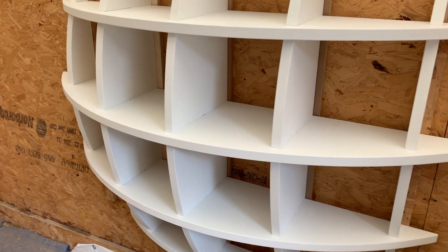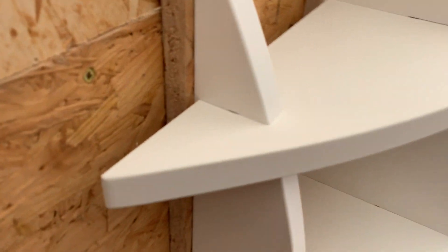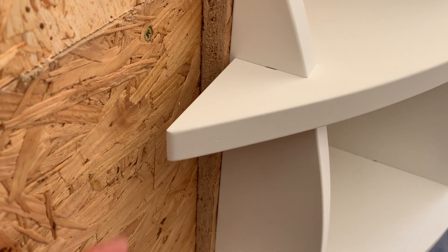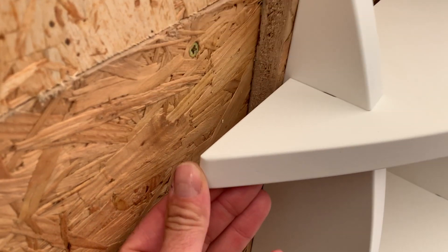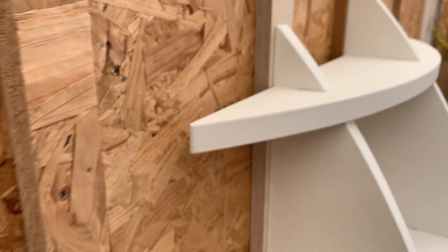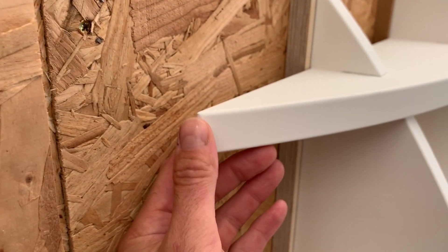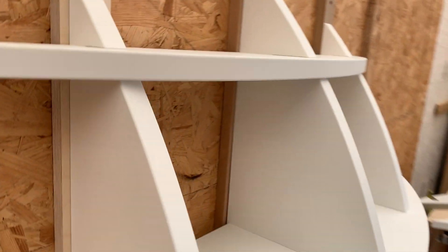One little mistake on the CNC: I think the drawing sent for CNC was just that this overlapping cut was a bit deeper than it should be. Doesn't really matter though — pretty much disappears. The final detail: looking at the way Thorsen Joinery did it, we'd been debating how to finish these very fragile edges off because they come to a very fine point. We went for just taking it off a little bit. Just have to take care during transport and installation, but when it's up on the wall it will be tight to the wall — I think it'll work just fine.